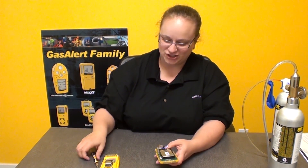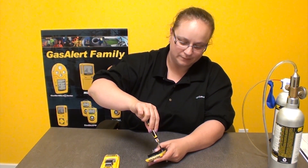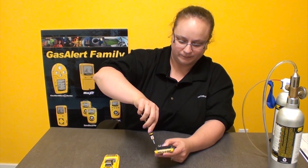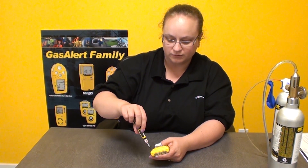The hole is actually labeled 'screw' on the PCB board — however, they are very tiny letters, so you might need a magnifying glass to see them. Tighten them down, but try not to over-tighten them or you're just going to strip the plastic. Then put your back cover back on.